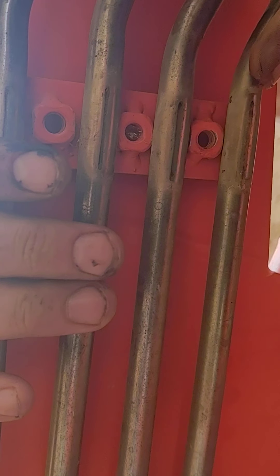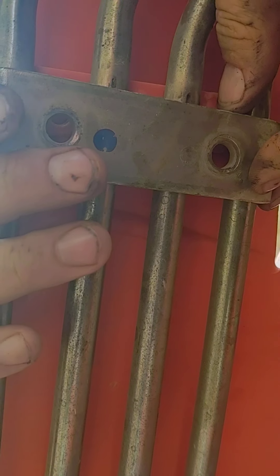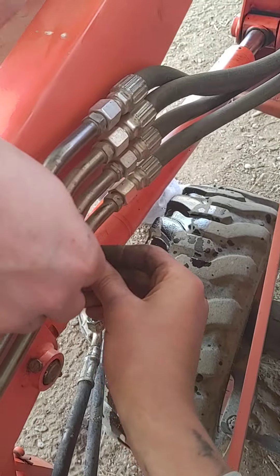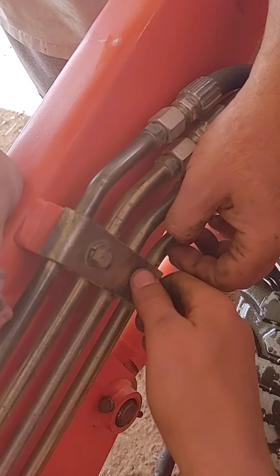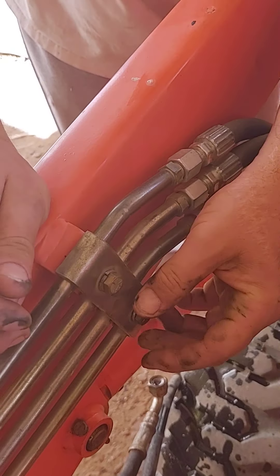You do have to lift this up a little bit so you can get that bolt out of the way — it's just two bolts in there. Those are half-inch nuts going there. You'll turn around and slap your bolts right back on there. That's the only difference between the passenger side versus the driver side — you don't have a problem with the other side because the hydraulic lines run down this side. So as you can see, we're good there.